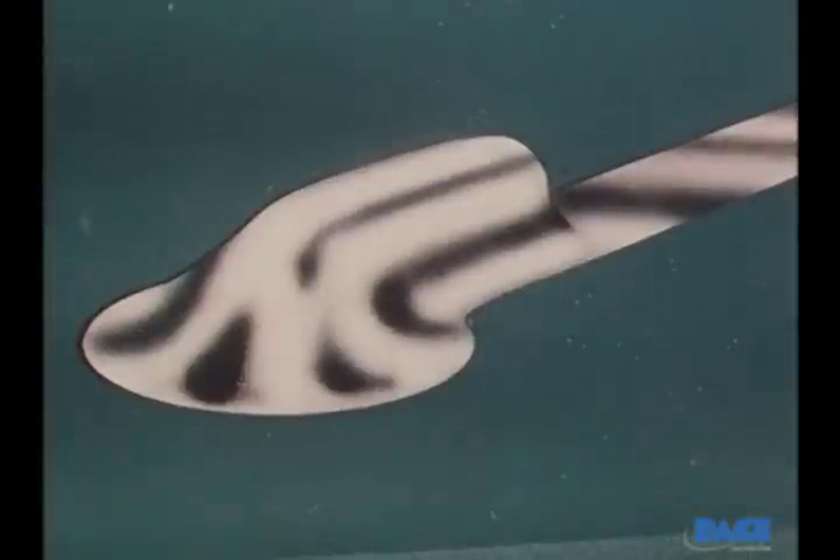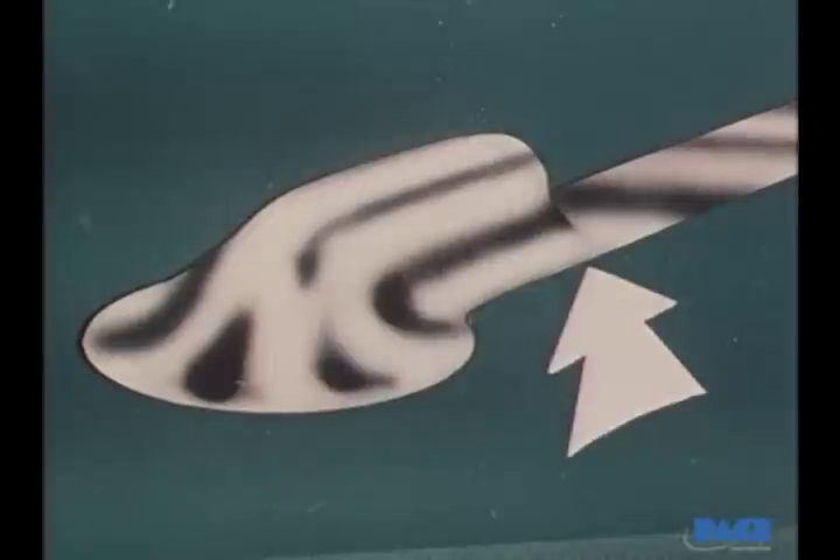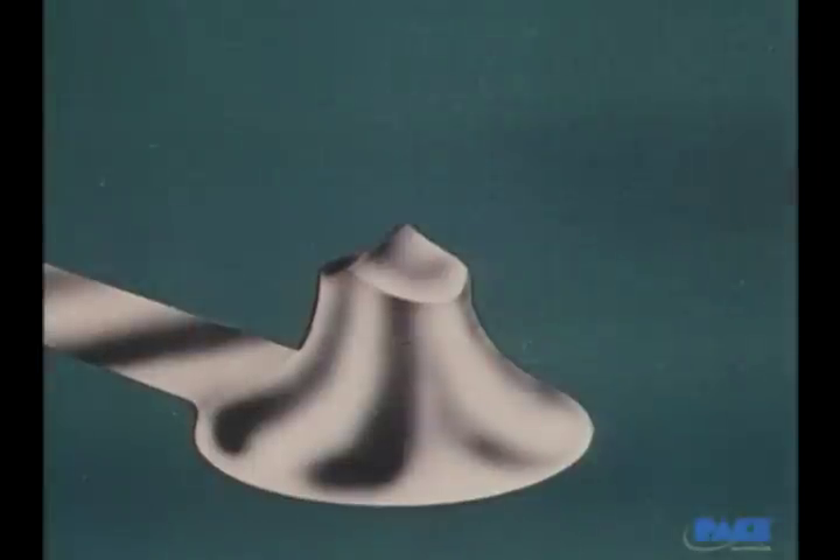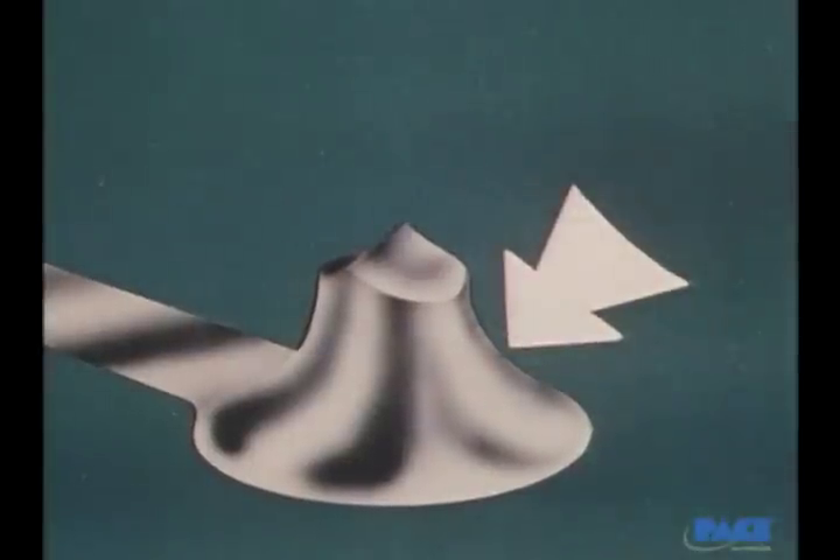With a clinched lead, the fillet should look like this — slightly concave and showing the shape of the underlying wire. The workpiece indicator here is the length of the solder flow along the conductor. An excessively long flow indicates too long a dwell time. With the straight through leads, the preferred fillet looks like this — again, the slight concavity and smooth, shiny surface.